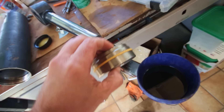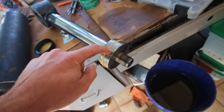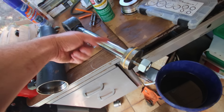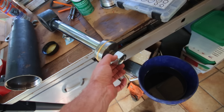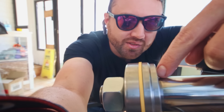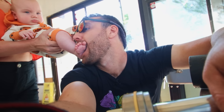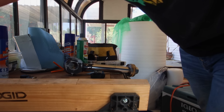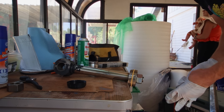It's a very important nut because that nut holds the piston on. This piston is what's receiving all of the force of the hydraulic fluid and actuating up and down — it literally has to eat all of the force of this thing, like tens of thousands of pounds pulling on this. It put a bunch of wear marks on the piston head. I've actually never really torqued anything before. A thousand foot pounds — how bad could that be? Then you go to Harbor Freight and realize the largest torque wrench they have goes up to like 250 foot pounds. That's when I realized I was in trouble. I went on Amazon and realized it would cost probably $500 to buy a torque wrench or all the equipment to do a thousand foot pounds. So I made my own.